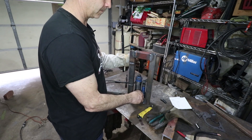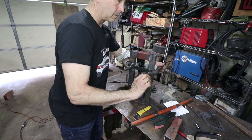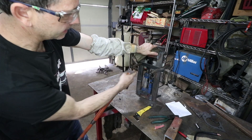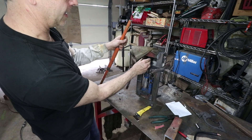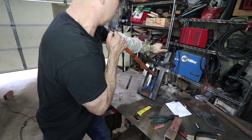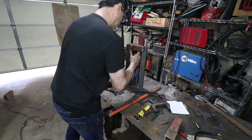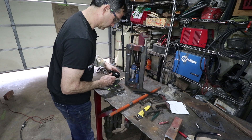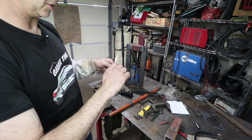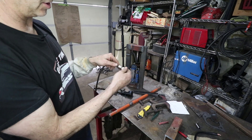I'm going to load this in this way. The wire's in. I'm starting to see it misalign a little bit — it's kind of turning this direction, so I'm watching this junction right here really carefully as I push. I think it's crimped. Let's check it out. It put a really big depression in there. The back side kind of kept it in a V, and then this thing just drove right into it and put a big dimple.